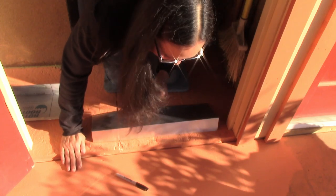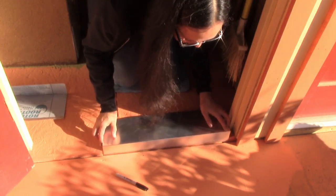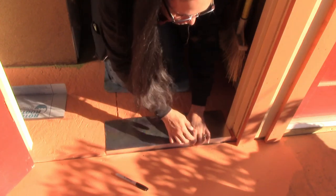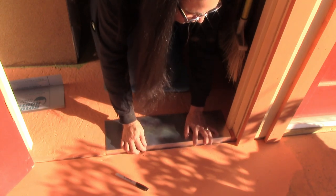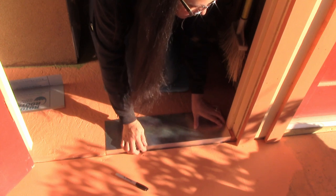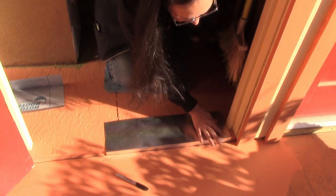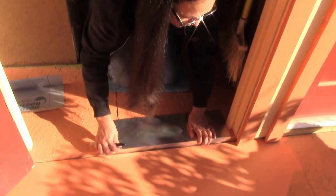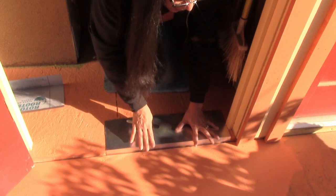So here's what's happening. I'm going to be putting this flashing type thing down here — this is what I was using for flashing when I was doing the roof. It slides right in there, and I did take my little blower and blow out the crevice to make sure there was as little in there as possible. So it's going to fit on there like that, and then I'm going to cut over here around this to make sure it snugs all the way up against the wall. I'm thinking maybe I should have it go up the wall just a little bit and slide in past there — I think that's a good idea. So I'll cut this extra deep so that I can do that.